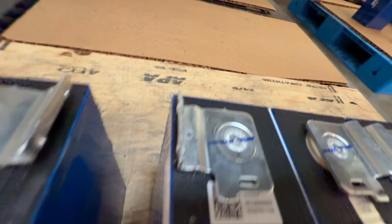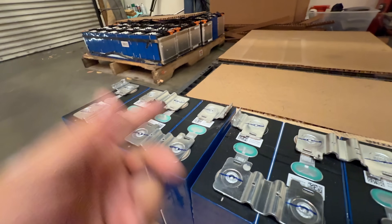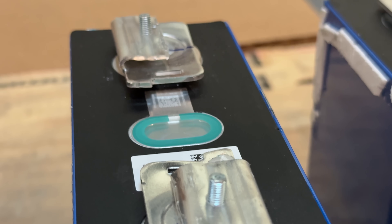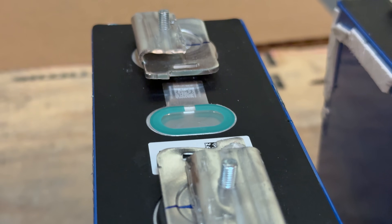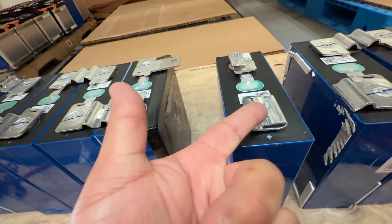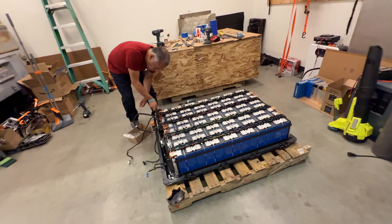These are aluminum bus bars and you can very easily bend them, like what we did here. Then you just drill holes, put ring terminals and cables, attach another string, and bend the next one in. I even bent these on their own and put a screw in there, so you just put studs in. These studs look a little small — this is M5 — but most commercially available cells of this type use M6, sometimes M8. In DIY, you can put whatever thread you want. You're the boss.